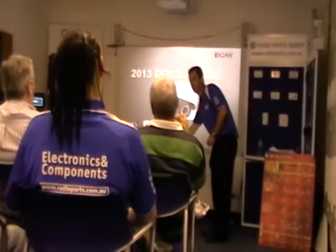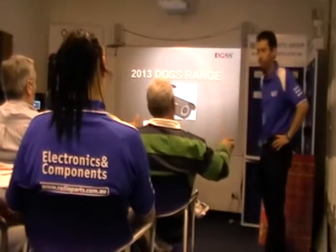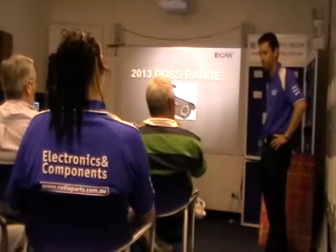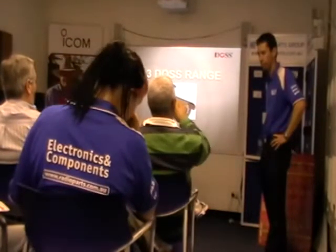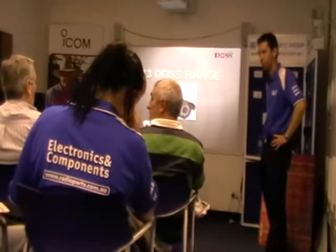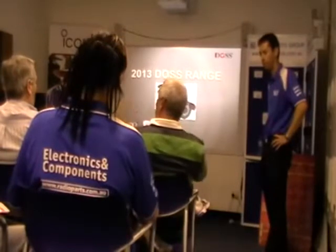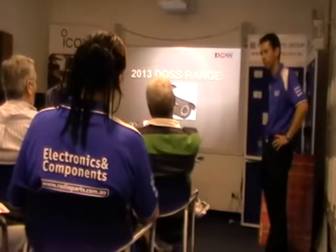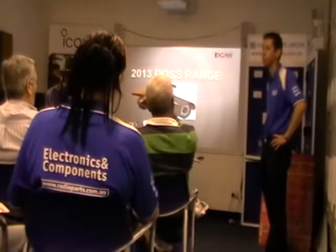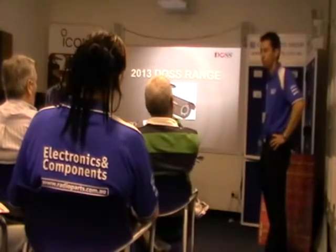I've had instances where a customer wants a signal from the camera to go to the DVR so you can record it, as well as, and I've spoken to you about it as well, where they actually want us to feed that signal back through a monitor. Say when you go into Coles, they have got a camera right at the door, and then they've got a monitor there. As soon as you walk in, you see yourself walk up. Normally what happens is you go through the DVR and then it loops back out to a monitor. With that, you can actually go directly from that camera through composite video out directly to that monitor right then and there.